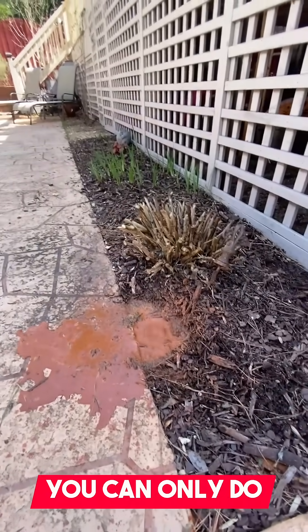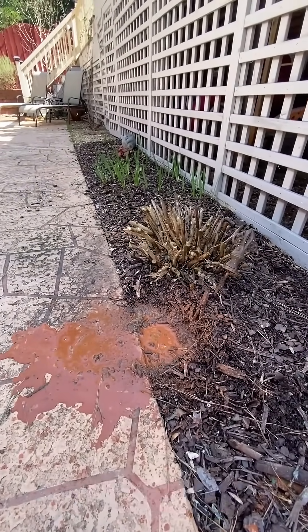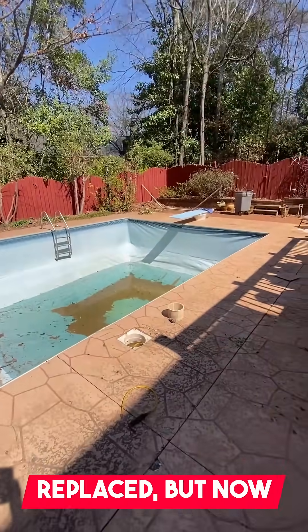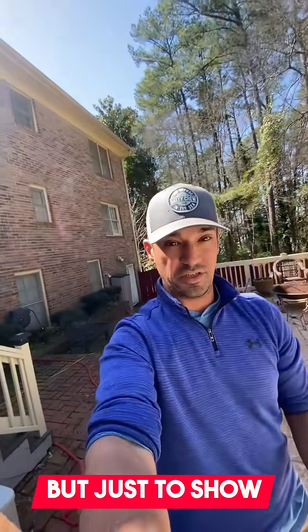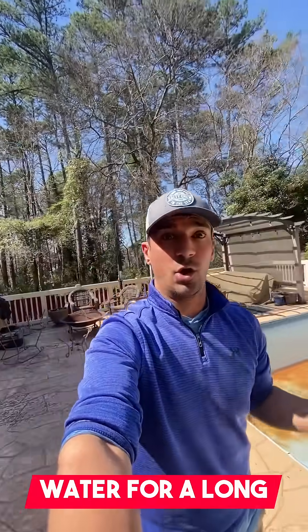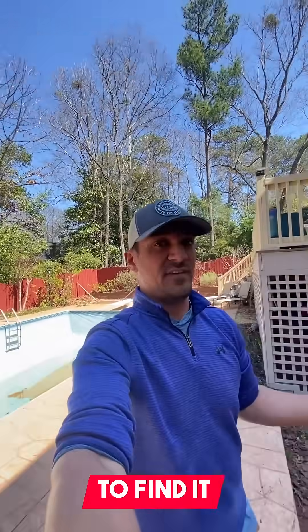This is the reaction that we want to find — we want to cause a whole bunch of commotion underground that we can actually hear, and you can only do that by getting that soil really, really sopping wet. When you hit it with air, it's sloshing all that stuff underground. The liner is going to get replaced, but now we've been able to pinpoint the break on the skimmer plumbing line. You have to be able to flood that plumbing line with water for a long, long time to get that soil sopping wet if there's any chance you're going to find it underground.